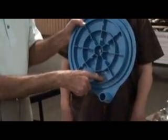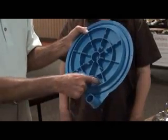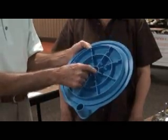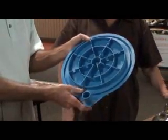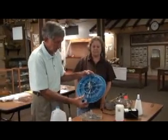It's going to be coming through that hole. We want the wick right here, if we can get it here. We want the wick lying flat on the floor, so when the water gurgles out and gets in here, the wick touches the water, and once the wick gets completely wet, it will wick the water up to the bulb, or the wet bulb, and that's what we want, because that's going to give us the wet bulb temperature that we're looking for. I'm going to use another blue base without a floor that has the egg ring assembly to show you what that should look like.